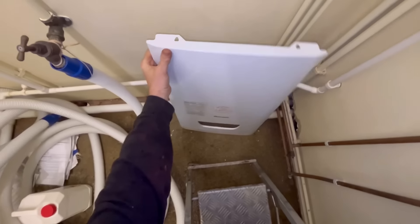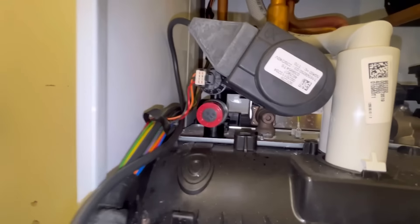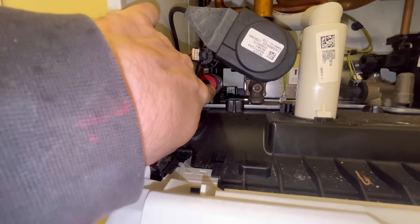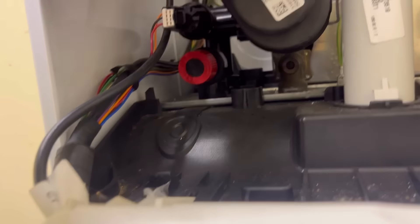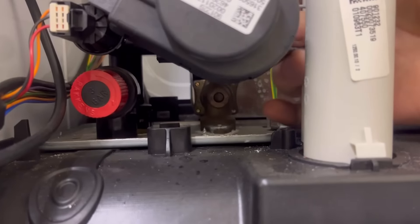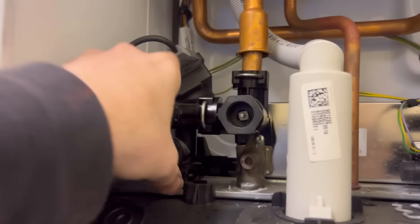Let's take a look at this week's jobbing episode. There it is - PRV. It's plastic, it's different to the one I've got, it's all built in. What we're going to do is actually drain it from there just because it's coming out anyway. Turn the pump off, open the PRV and get that replaced. Check the vessel - let's get this diverter out of the way, it's just a pink basket there.